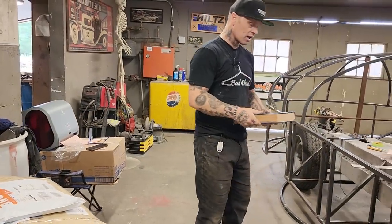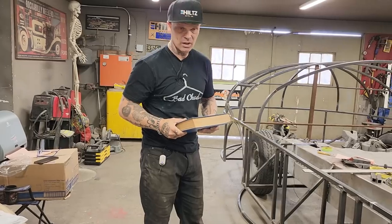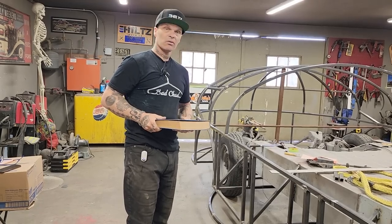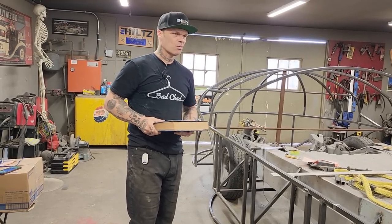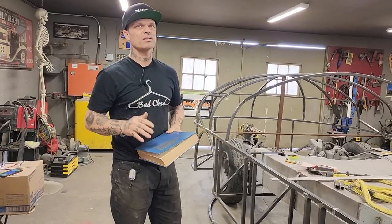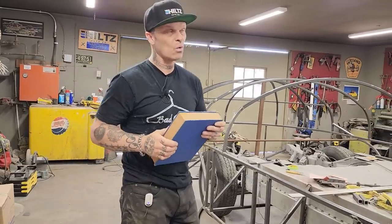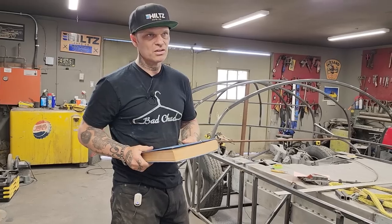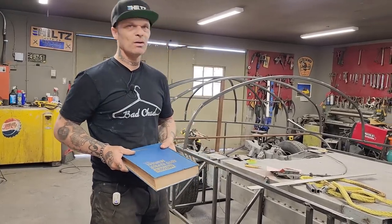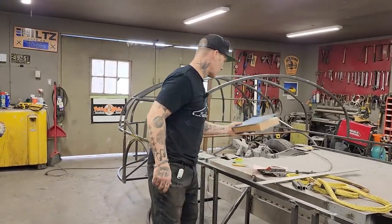They brought me over a book yesterday. And my best memory of Hub and the old cars is I had a 56 Mercury one time. I was going to take the motor out of it. It wasn't working that good. Didn't have much power. I thought I wanted more power. Hub said, let me take a look at it for a minute. He adjusted the points in the car. Never really got in that situation before. It was my first old car. He adjusted the points in the car, and man, it was just like a brand new vehicle. And it was like, wow. I did not take the motor out of the car. The car worked awesome. But anyways, thanks, Hub and Liz. I appreciate it.